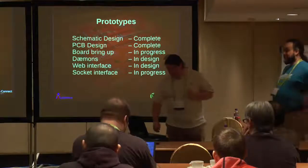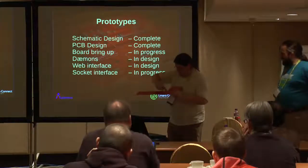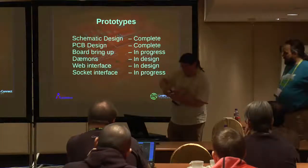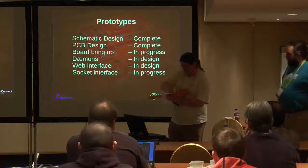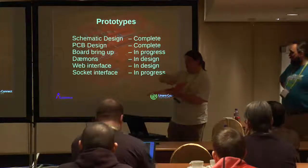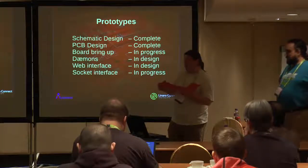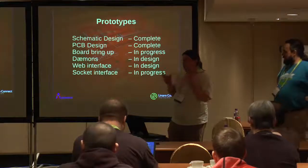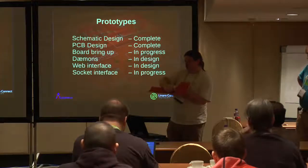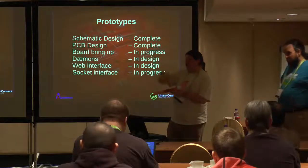What does the 8 unit version look like? Exactly the same. Okay. This section here is literally cut and paste. So effectively, chop that off. That sits as a daughter board. So we've got mounting holes in position, and we've got an FFC connector. You've got 2 spare channels on the uplink USB hubs, so it's literally a copy and paste circuit. Okay. So on board bring up, I only need to confirm this, and then I can just confirm by strapping across my connections that it works on the other two ports.